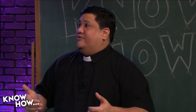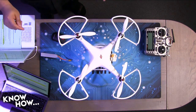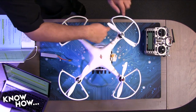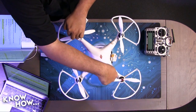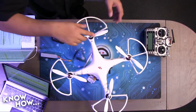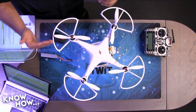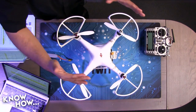Now, yaw — actually turning the craft — is trickier. There's no control surface for yaw, no tail or rudder to deflect air. The quadcopter takes advantage of torque: two props spin clockwise and two spin counter-clockwise, always. If all four spun the same direction, the quad would just spin uncontrollably. Having two in each direction means the torque forces cancel out, so the craft naturally stays pointing the same direction.